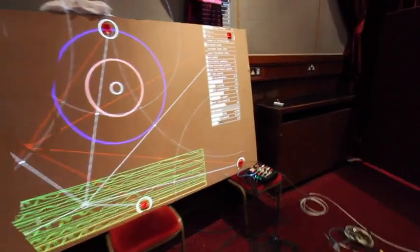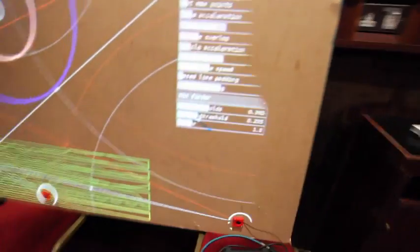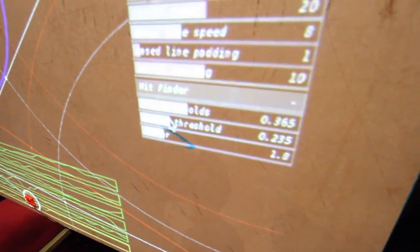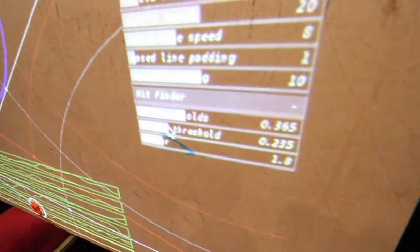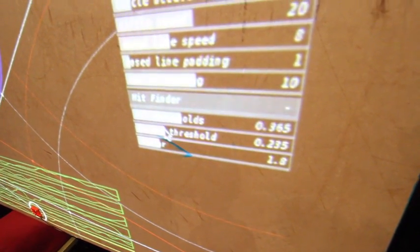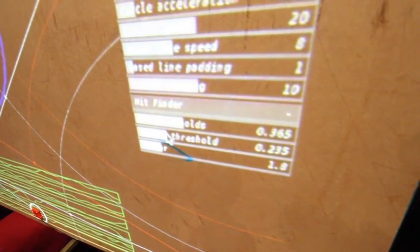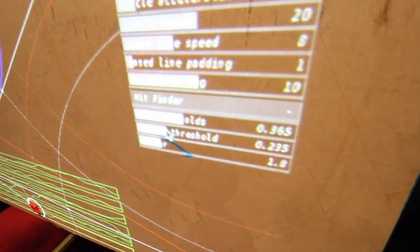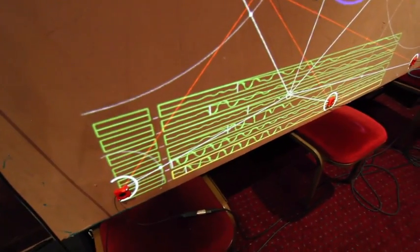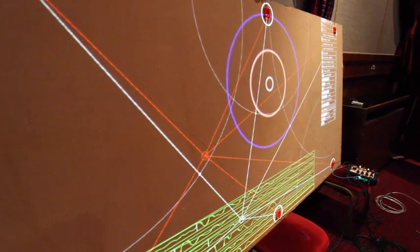There's just a ton of different settings that I've been working on, trying to adjust. You can see there's the threshold for the first volume that is registered as a hit. So if I've got particularly loud sounds, I can turn the threshold right up, because once the volume goes over that threshold, I register a hit. Then I've got the secondary threshold, that's for the subsequent hits, and the level that they need to register.